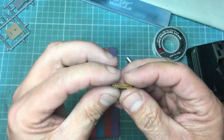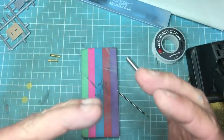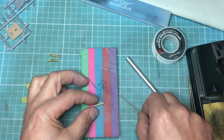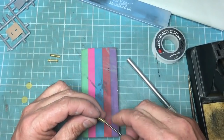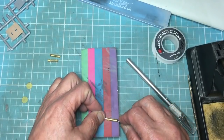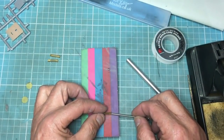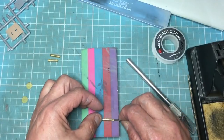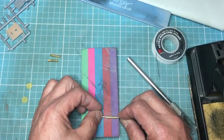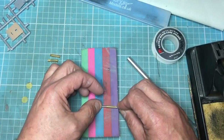When you look at it, you can see it's not quite joining — there's a gap — and I need it to butt up. I need it to overlap slightly so that I can peel it apart but the edges stay together, ready for soldering. If you start to see the ends are stepped, just make sure you've got the drill nice and square, go over it, and you can manipulate it back into being a cylinder again.